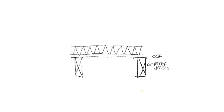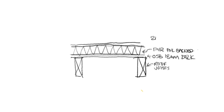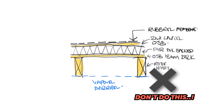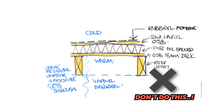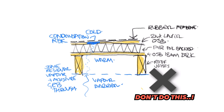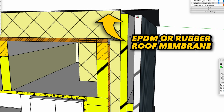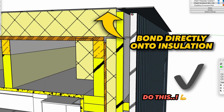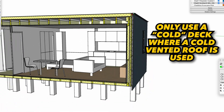Now, warm roofs. Using a plywood or OSB deck over the insulation is a problematic practice unique to the UK. Single ply fully bonded systems are designed to be bonded directly onto the insulation. Sticking a layer of composite sheeting with a load of impermeable glue increases the likelihood of the dew point being within the timber, and your roof deck will eventually fail — along with the membrane bonded to it — as you get interstitial condensation.